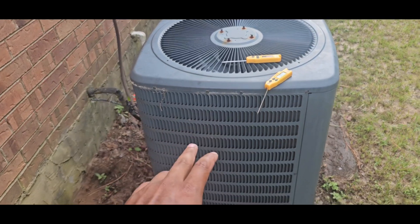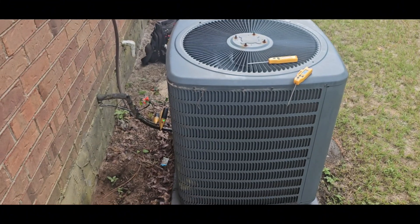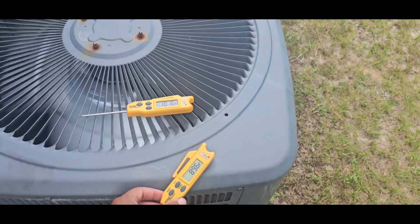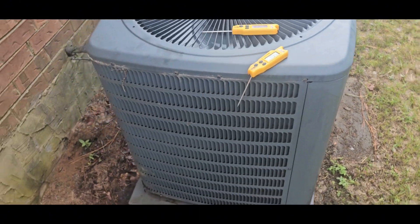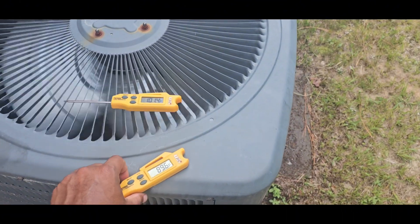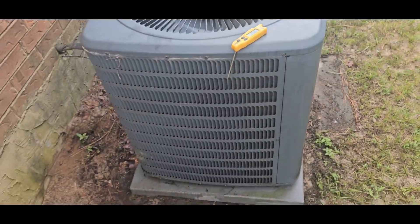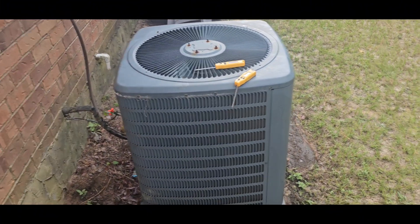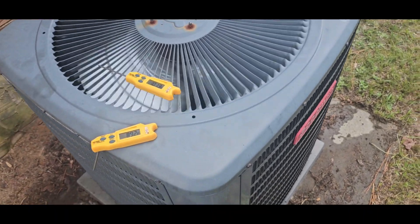I know I've had to tell Jacob quite a few times that when you see your head pressure just skyrocket sometimes, to just double-check the condenser coil. That's why I kind of use these little probes to try to gauge the split temperature. Cause unless it's an R-22 unit, anything over 20 degrees on 410A — I'm gonna try and clean it first before I deem it an overcharge or something like that. Just to try it. And I'd probably say 7 out of 10 — 7 to 8 — cleaning the coil solves the issue, just like it did here today.